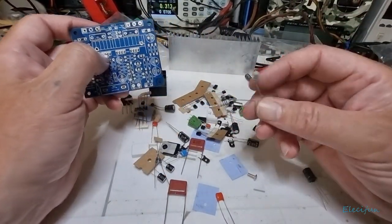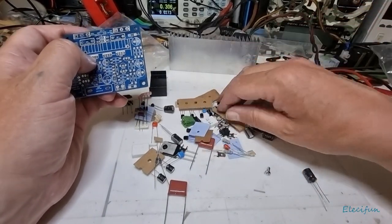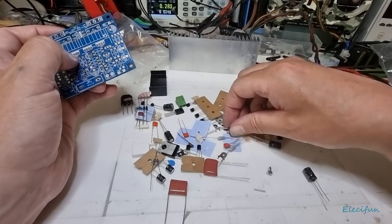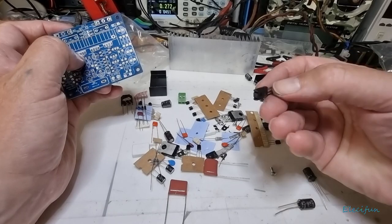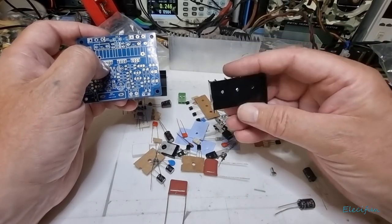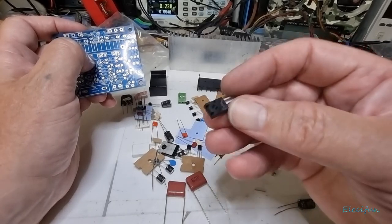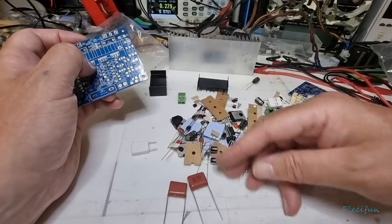Looks like one-watt resistors. We've got our bits here — the insulators for the transistors. It looks like there are just four insulators, but these ones here — looking at the backs of them, the cases don't have any metal, so you don't need to insulate them. This board has black stuff on it anyway, so you should still probably put insulators on if you've got metal backs, but these ones don't.